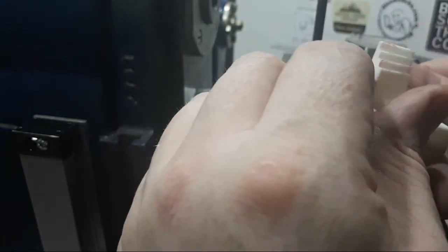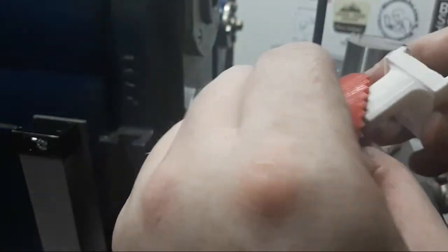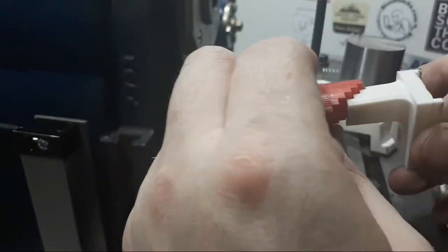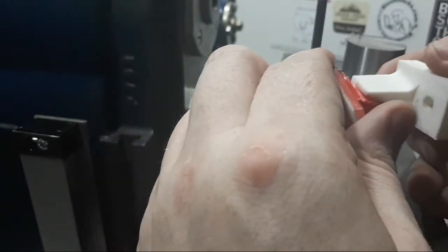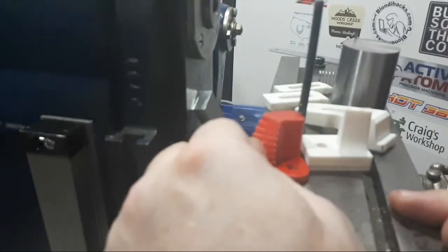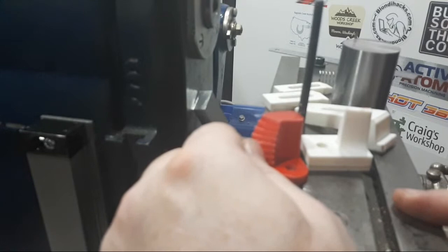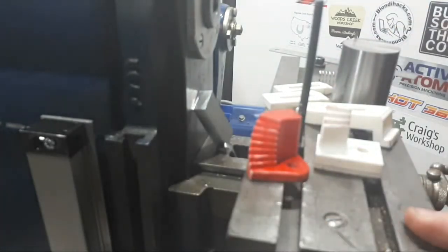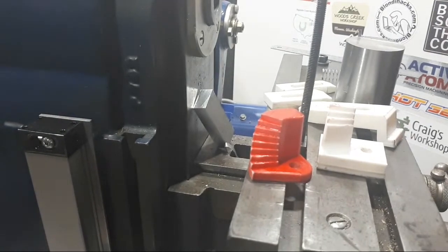And I don't know whether I might shell cast these in bronze. Might be a good way to do it. Probably they're not difficult to machine up out of 12, 14, something like that, and case harden them up. That might be as good a way as anything. Or we could do them in P20 or 4140 or something if we're really feeling energetic. I'm not real sure about that yet.